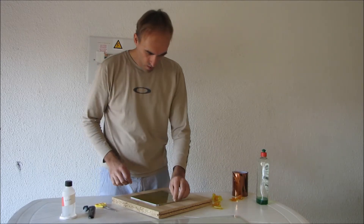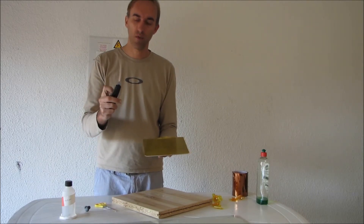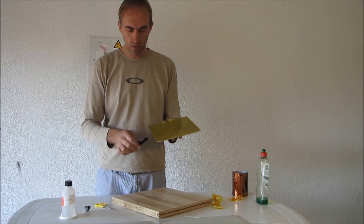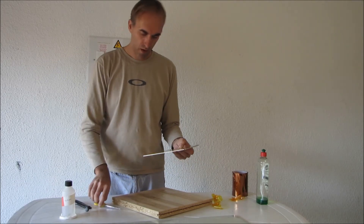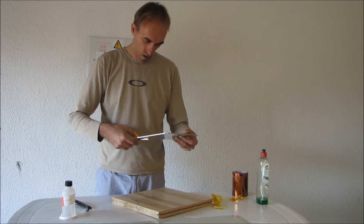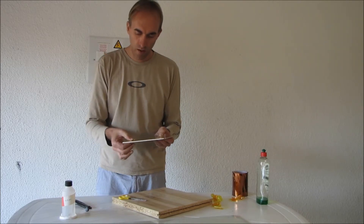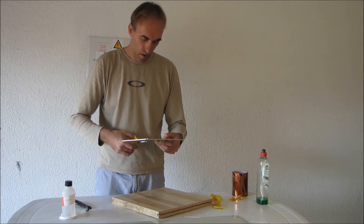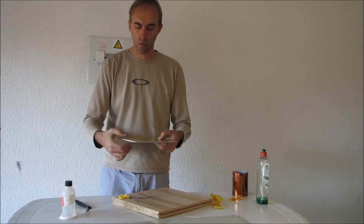You really do need to actually leave it to dry some more. What I quite often do is when it's completely dry, I take a normal little stanley knife and on the top just scrape against the side of the plate — that cuts through the top and you get exactly flush mount all the way through. What I'll do right now is just cut little notches right in there, and that bit I don't cut flush as I said — it provides just a little bit of insulation near the high current bits. Those I actually leave on as well — they'll stick when it's dry.